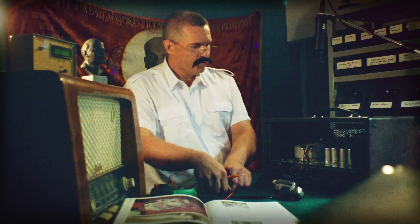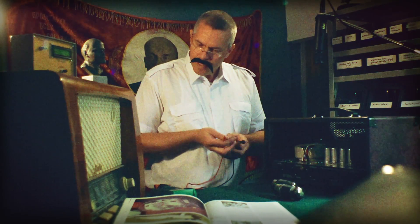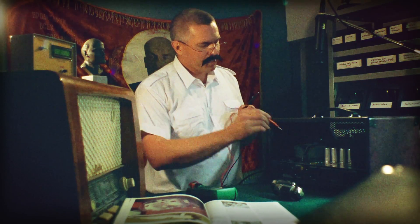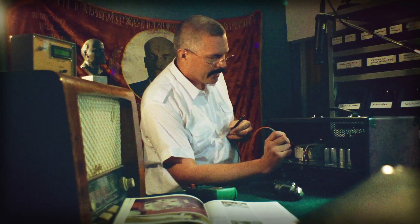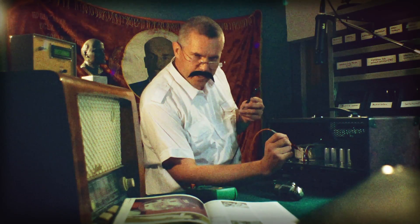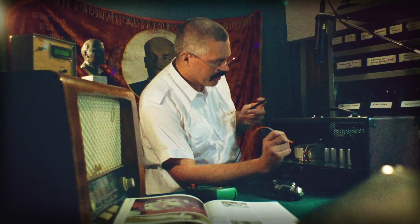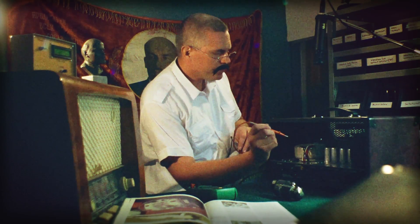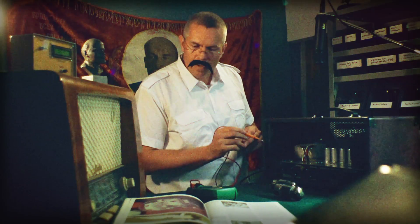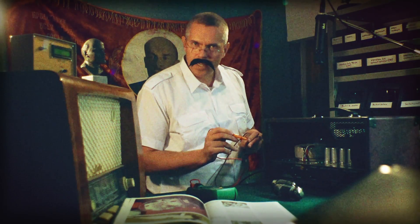Now I shall proceed for the test. We are testing pins number 3, 4 and 5. This probe is our ground connection, therefore I shall connect it to anywhere in the amplifier that I can get ground. We want to see two very high voltage readings and one minus reading with the smaller value of direct voltage.